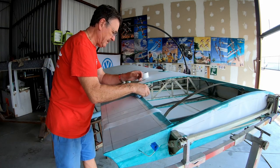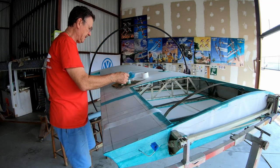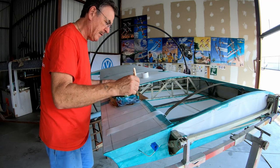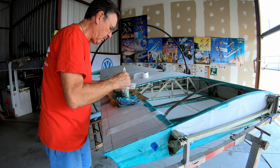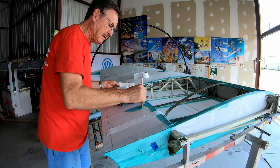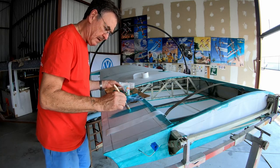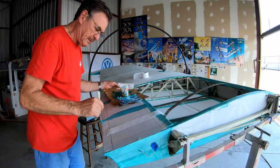And again, just make sure everything is nice and saturated. I don't worry about the pink edges staying up a little bit, because after the whole ring is done, I take my small iron at 250 degrees, and you go over all the tapes. If you see any bubbles, and especially you go over the edges, the pinked edges, and iron them all down. And that might be a process you may have to do a couple times,